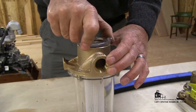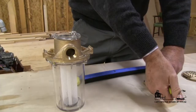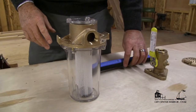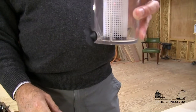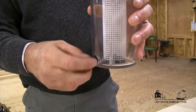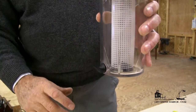It doesn't have to be real tight — just snug. Then you would go back, open up your sea cock, and check for any leaks, because you don't want the bilge to fill because you've got it cross-threaded. Also on the sea strainer is a drain plug for draining the water out of the plastic bowl in case you are in a cold weather climate.